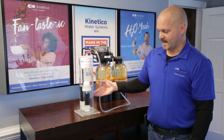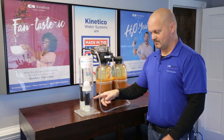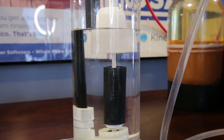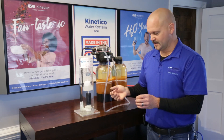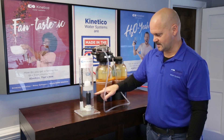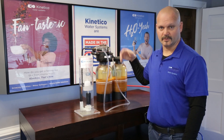When it's pulling that saltwater back out, we already know what the high level is, but it will actually draw it out until it drops and no more water is spilling over. There is a black tube in the middle with some cutaways, and a specific amount of salt dosing requires a certain amount of cutaways to be removed. The water keeps overflowing until it gets to the point where it's even, and that's the low level. So basically this much saltwater is all that this unit would use for a regeneration.